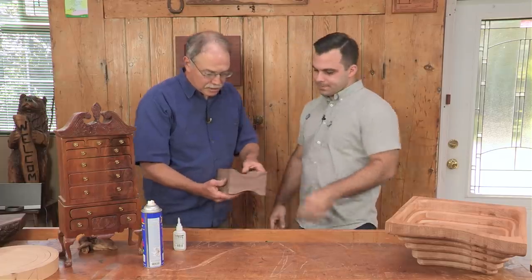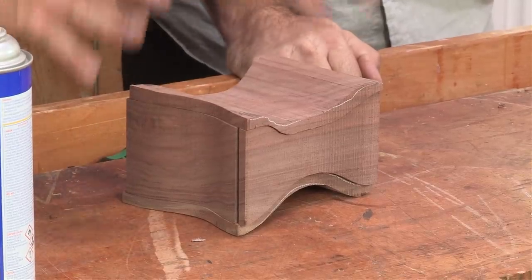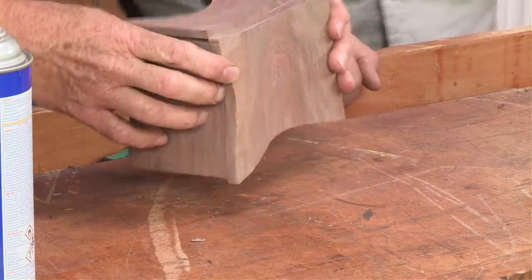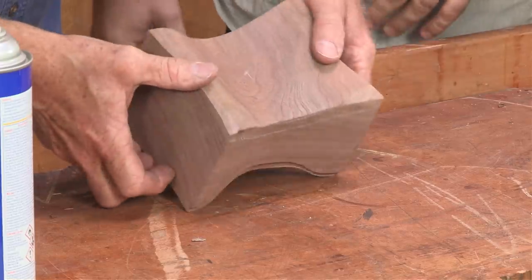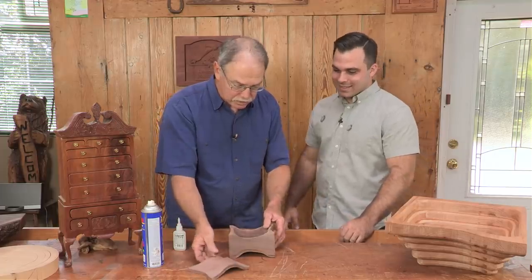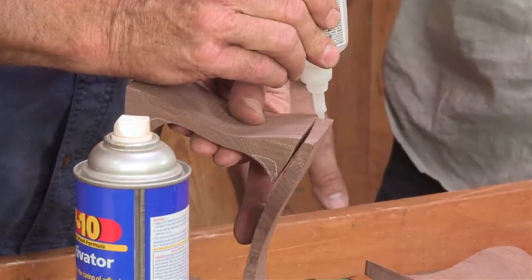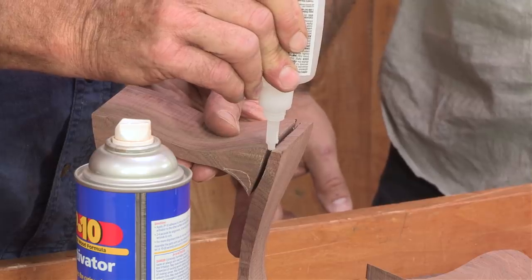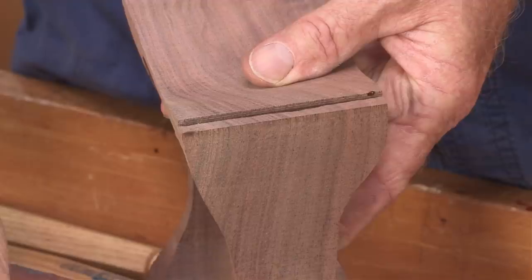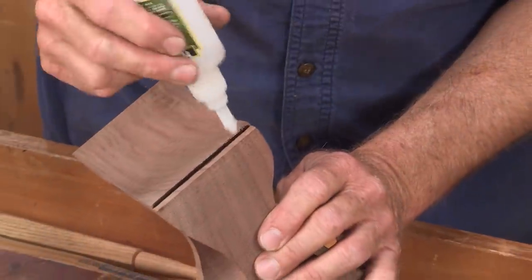Alright Scott, I think I got all the pieces here. I like everything — the shape, it's standing proud, beautiful grain right there. Don't sand it until we do this next step. So there's that beautiful grain pattern on the top. We take the walls — there's the entry cut right there — and you take thick viscosity super glue. You open that joint ever so slightly and lay a real healthy bead of cyanoacrylate adhesive in there — the thick one; this is the Instabond by Titebond. You exercise that joint so gravity makes that glue go all the way down into the joint.